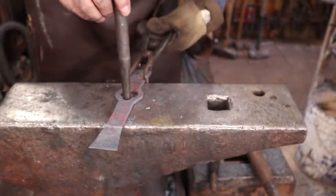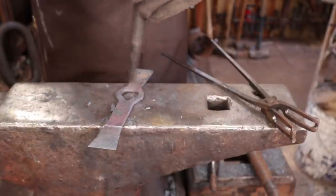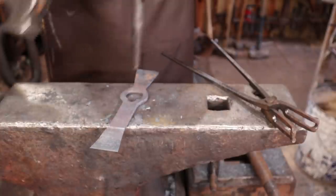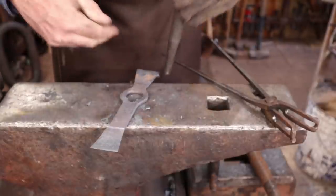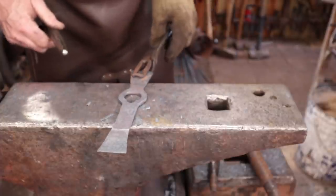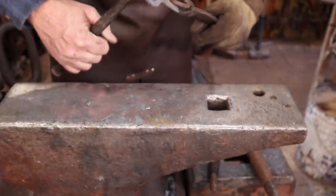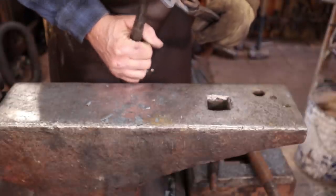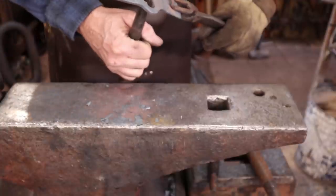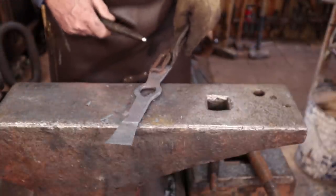I'll let you use a ball punch — I put this on the top of this. You just drive that down in there and then slowly work to the edge until you get what you want drawn out into the ring. I put it on the top side so that when you open a bottle, you're bringing your bottle vertical and you're less likely to spill. If you put it on the bottom side, you have to open this way, and as you get the cap off you're starting to pour out. So I think this is going to be a better solution.